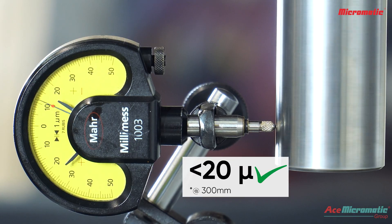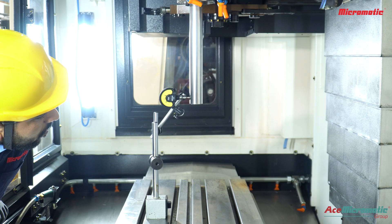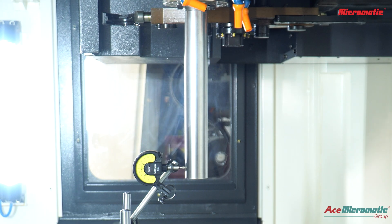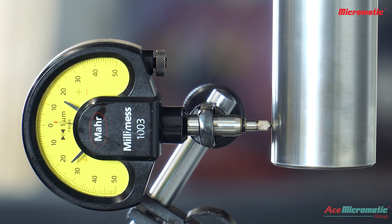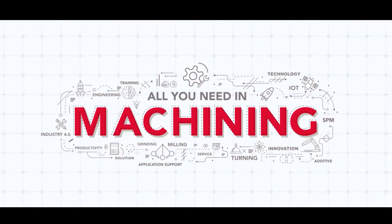This method states that any value higher than 20 microns will result in inaccuracy while machining. Measuring runout at different lengths — 150 mm and 300 mm — on the test mandrel helps to understand not just the accuracy at the spindle nose, but also how any slight wobble or misalignment might magnify further along the tool length. Subscribe for more CNC tutorials and share your results in the comments.